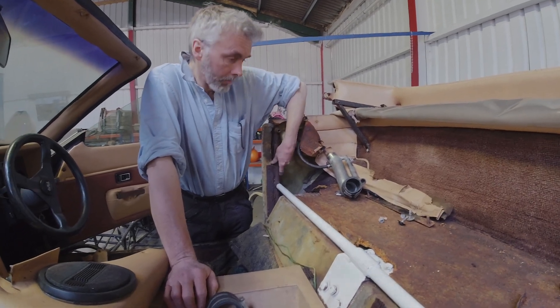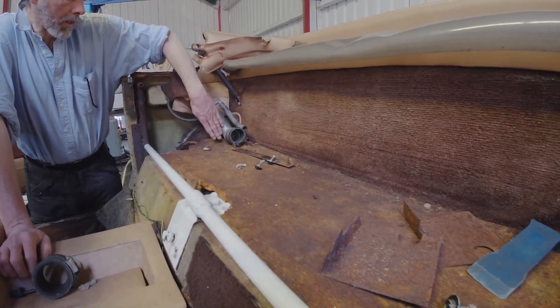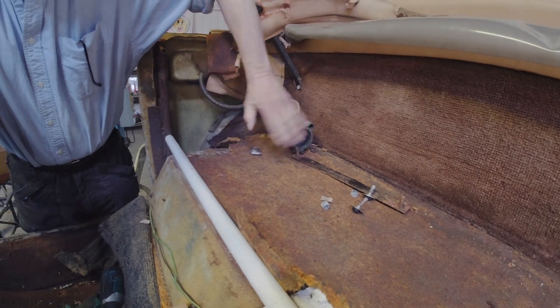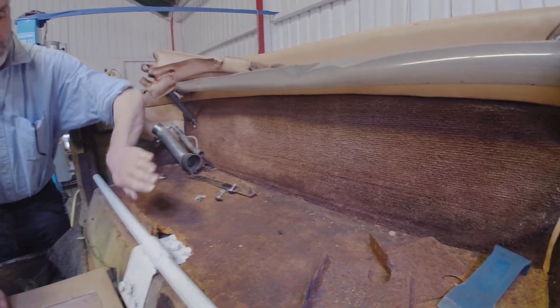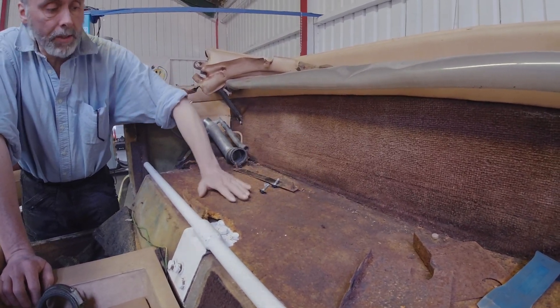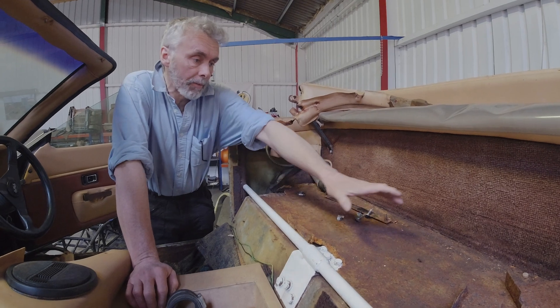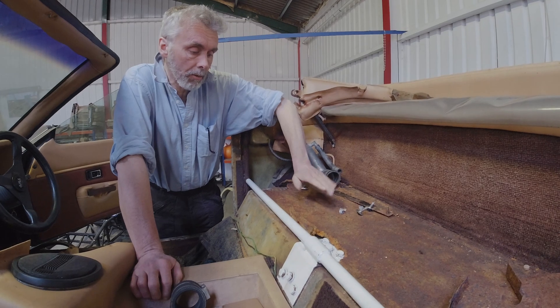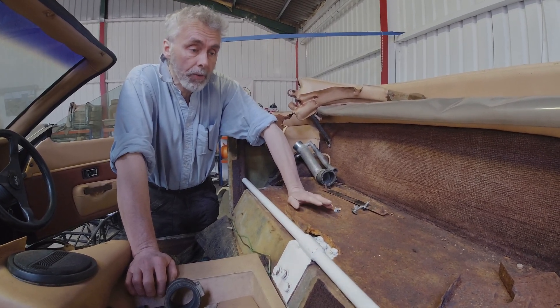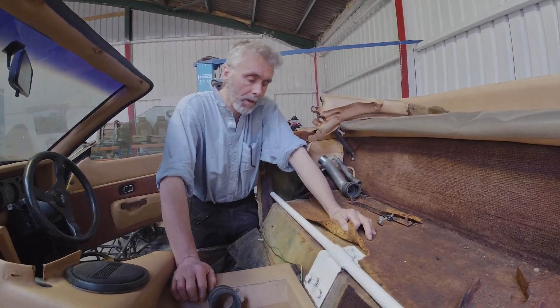The reason we're doing all this - why are we doing this, Ralph? Well, A, to try and get this all refurbished so that you actually stand a chance of surviving in the car. And the second thing is we're going to cut this top panel off completely - this will all come out and we'll make a new one that comes out and down. The reason being is that this is where some of the batteries are going to go. We're going to get a layer of about seven modules across the top there, some more underneath, but we just need that little bit of extra headroom to get this set over the rear wheel, so you'll actually have some weight over the driven wheels - it's entirely possible you could actually have some grip.